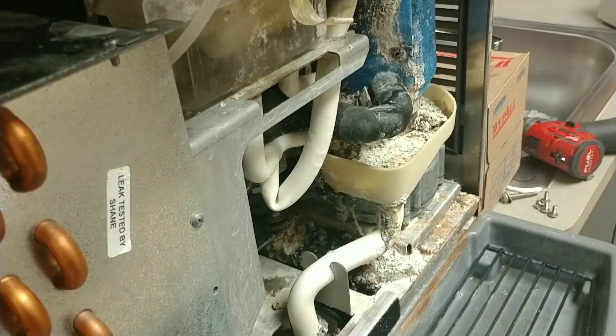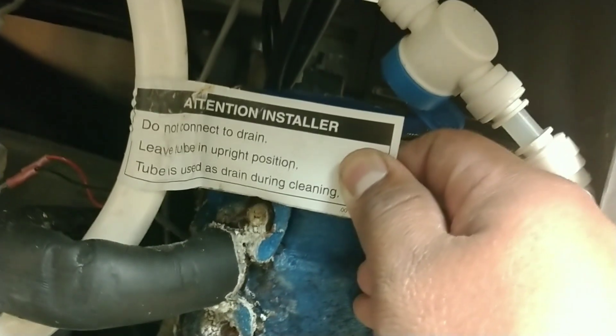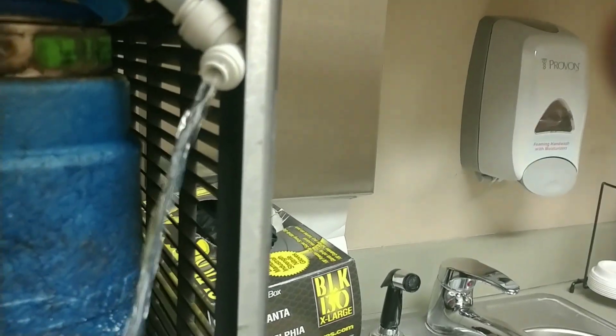We actually don't need to do that yet. So we're gonna start by here — the tube in the upright position. The tube is used as a drain during cleaning. Pretty smart, I like the way they did that. So you just take it off here, bring it down here, and you're dumping all the water in your reservoir. It's actually dumping out the water in your evaporator as well. If this valve was open, you'd also be filling that back up, so you need to have that valve closed.